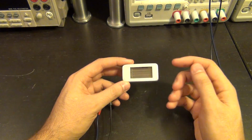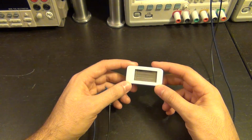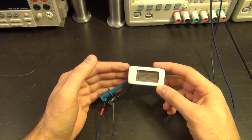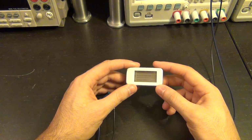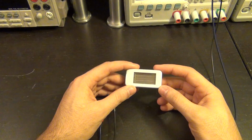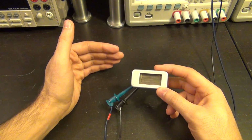Now, as soon as that happens, the conductivity will shoot up significantly. And of course, you don't want to stay in that mode of operation. And in that case, normally you'll have to immediately drop the voltage below the ionization level, and then the process will stop and the conductivity will once again drop, and then you have to raise the voltage back up again.